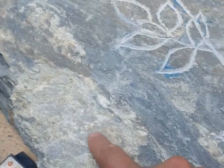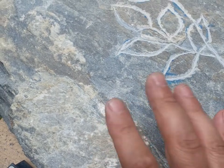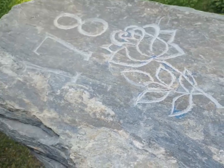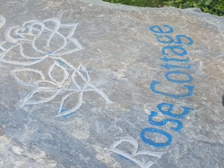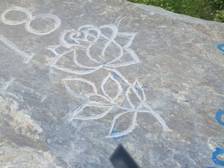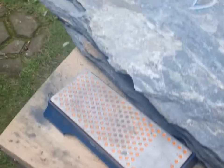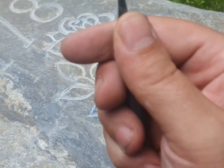It's been really challenging, especially this particular stone. It's got some really extreme different layers to it — it's a very hard type of slate with a heavy quartzite structure. And when you try and cut this, it doesn't cut, it shatters. Normally on slate I can go probably two hours or so before sharpening my chisels, but on this stuff I'm sharpening every 10–15 minutes using a diamond stone just to bring the carbide up to a nice razor's point.